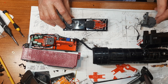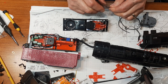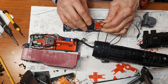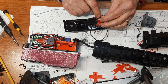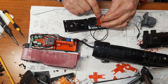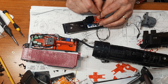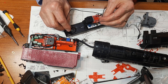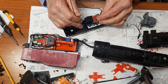Then connect your wires like we said — the front truck wire comes in like this and you poke it down that hole, put some solder flux and solder on here, and solder it in really tight. Make sure it's tight, give it a little tug. Then do the front one the same way — bring it over here, cut it so you don't have too much slack, and solder that one in right there.